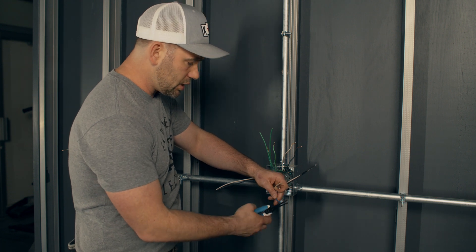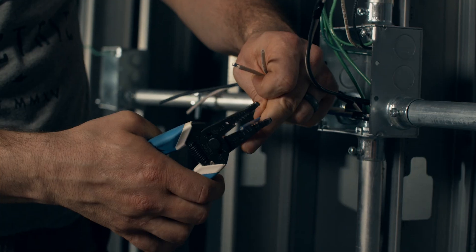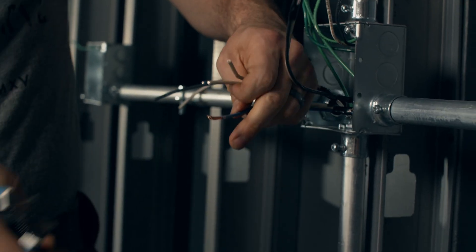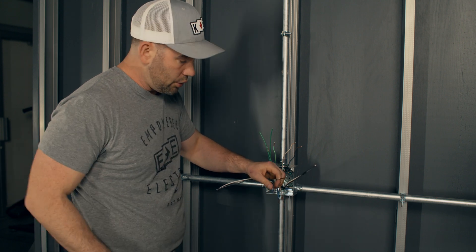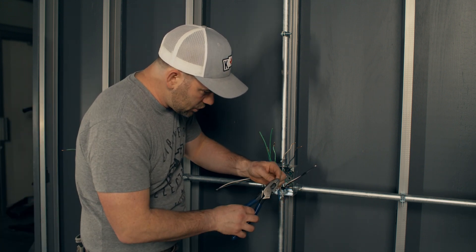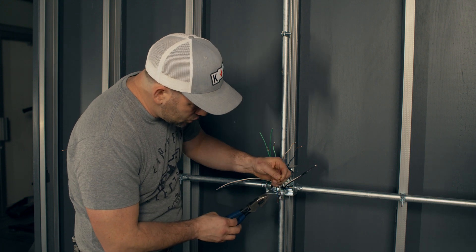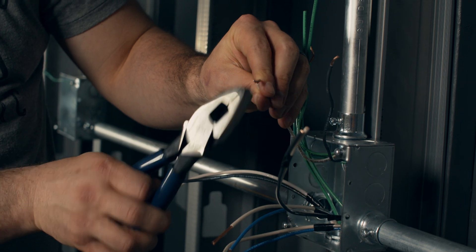So I cut them and then I'm going to strip them out. We always strip a little more than what we need. Stripping the insulation off stranded wire is a little more tough. You can see the strands — that's stranded wire versus solid wire. Solid wire, you can see here, solid copper conductors. Stranded is a lot of little strands. When you get to bigger wire, number eight and above, for the most part when you start to get into bigger wires, everything is stranded — the stuff that goes to your panel or big service panels.